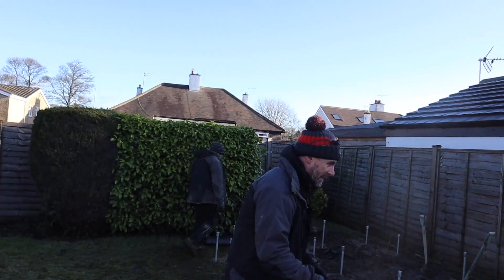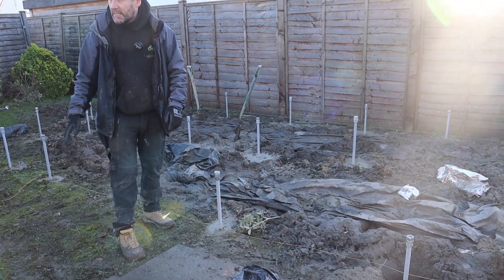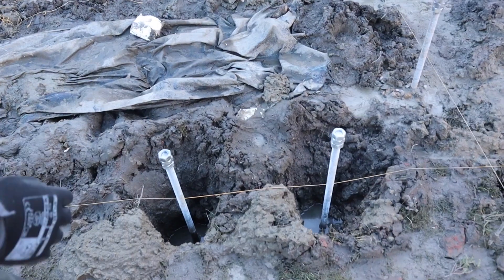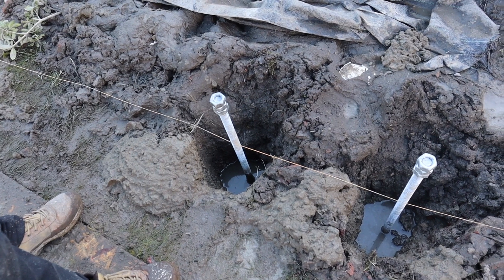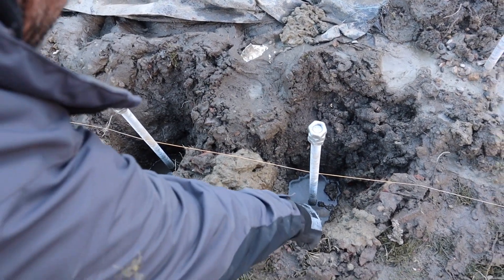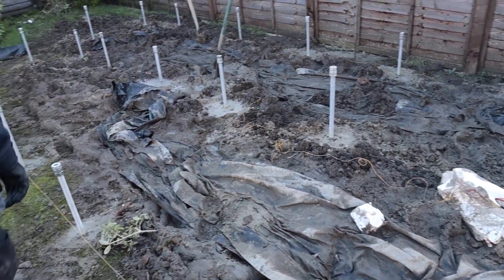So this is the second one — it's six metres long and three metres deep. Because it's three metres deep, we've only got one line in there rather than the two with the three and a half on the other one. John's just taken off the string line and we're going to do exactly the same as before. He's set the laser level up already. The reason why these two rods are so low is because there's a 15mm water pipe — a copper pipe — running through there, and concrete corrodes copper. We don't know if it's live or dead, so we've put the concrete below the pipe so there's no actual weight bearing down on it. We're assuming it is live, so we've avoided that.